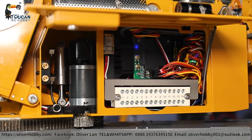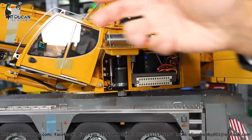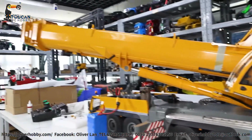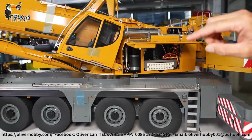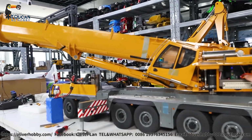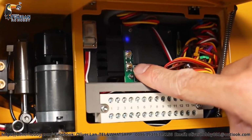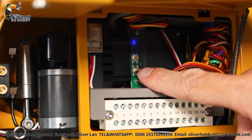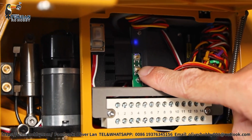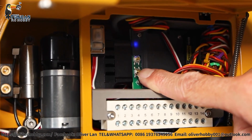But remember the procedure. When we are operating, we already extend the first boom out and go back. So it's already finishing first boom out and back, it's ready for pulling out second boom. So the procedure is not matching the boom position now. The first boom is always back, so you just reset it. It will be originally positioned, to match the procedure where the booms are. So only the bottom button, this one, keep pressing more than 5 seconds, will be reset to the original position. Let's go. 1, 2, 3, 4, 5.